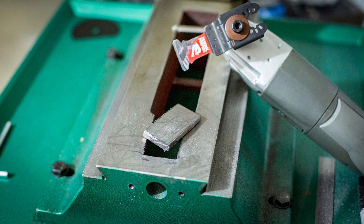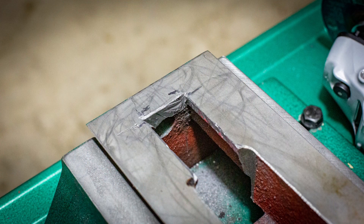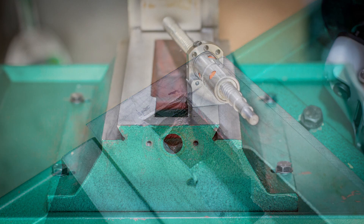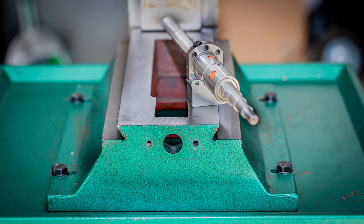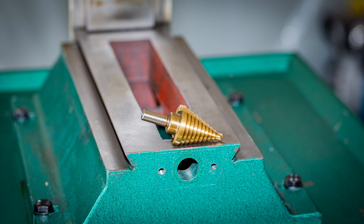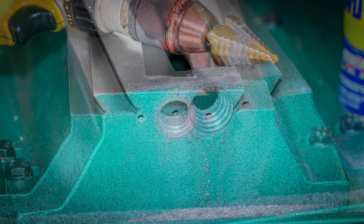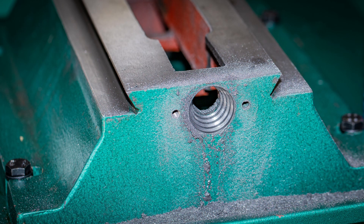Here you can see the thickness of the cast iron. With carbide blades it really wasn't much of a problem. The cuts aren't very pretty but they're no rougher than the iron casting. With the slot on the top opened up I turned my attention to the hole in the front. The only tool I have for enlarging the hole is a half inch cordless drill. I didn't have an inch and a quarter drill bit but what I did have was an inch and three eighths step drill bit, so I figured I'd start with that and see how it goes. I ran the step bit in up to the inch and a quarter step and that's where I stopped.